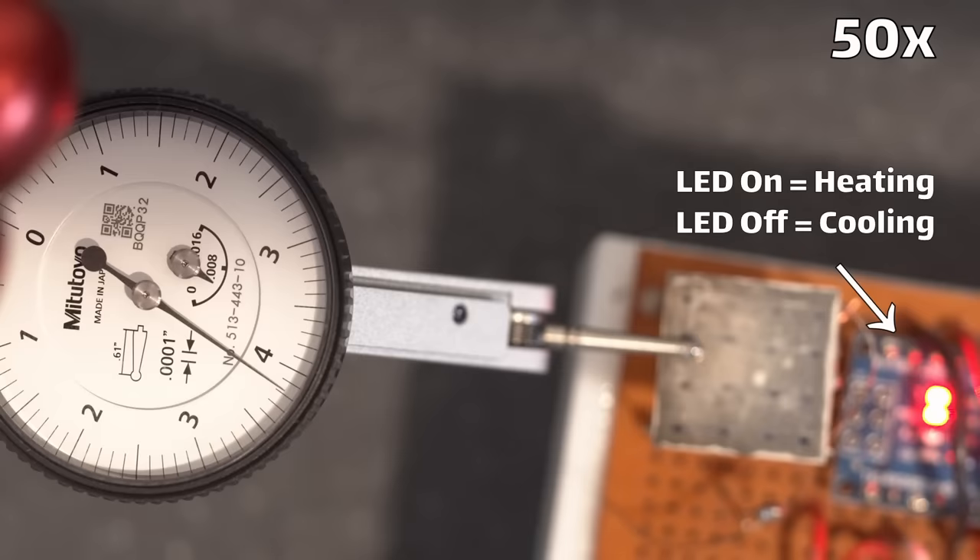It's not really a practical technique, even though it's a cool one for a hobbyist since you can throw it together in an afternoon with junk from your electronics bin. It's a neat teaching demonstration but not super practical for real-world applications. That said, the paper does make a point that it's pretty good at correcting low-order Zernike aberrations — things like piston, tip and tilt, and basic astigmatism. These aberrations are slow to change, so they don't need a quick response time, and the magnitude of movement needed to correct them is large. The thermal mechanism can get you large displacements — like 10 to 20 microns — pretty easily, which is more challenging with piezos.